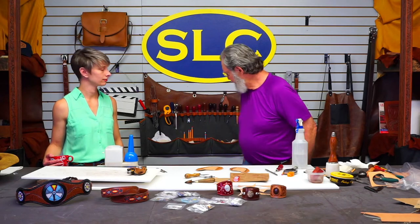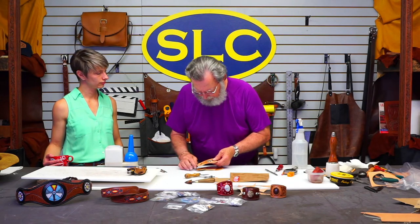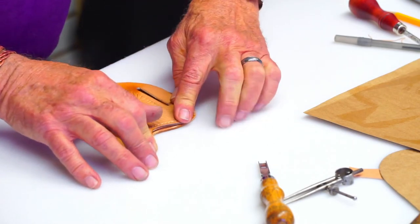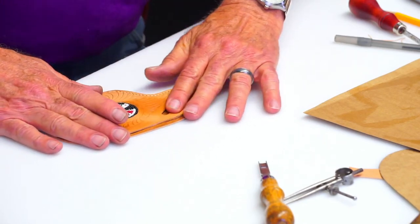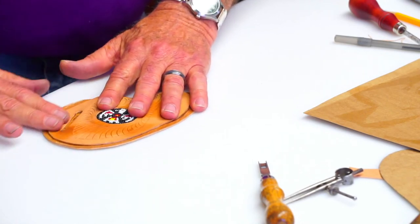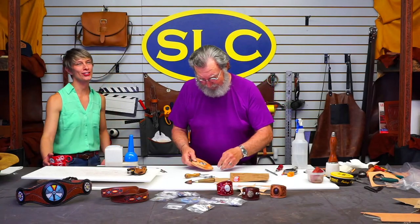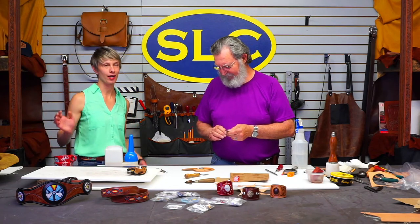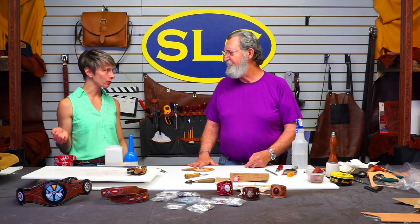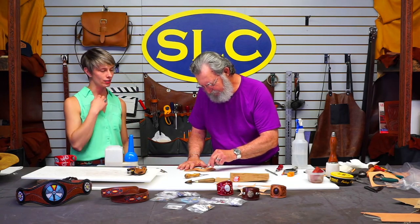The cement is tacked up. I'm lining up the top section — I cut it big enough where the bottom is going to cover no matter what. It's really a pain to try to line up edges all the way around something; it's nearly impossible. Oversize everything on your bottom, cut your top to shape, and then just trim it up. Your edging gets way easier that way — you don't have to sand nearly as much.